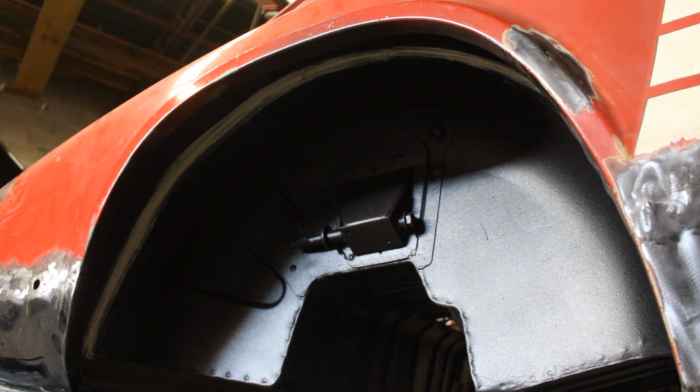Alright, I forgot to turn you on, but I just ran a bit of silicone there in this seam inside the wheel well. But on the other wheel, when the car was on the side, I put it before any primers and any stuff like that. I just put it on a bare metal. And then Chef Tash told me, you know what, it's better to put some base, like primer or whatever you're gonna put there, and then put the silicone. So that's why this time I put it after I have the... I should have done it before the bed liner, but I forgot, to be honest. But I was planning to do it after the paint, after the rust guard. So anyways, now I have 2 coats of bed liner there. So I put the silicone now, and I'm gonna spray 2 more coats, and that's gonna be it. I think that's gonna be fine for there.